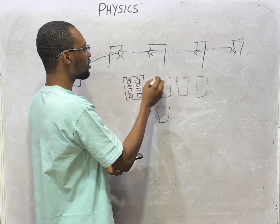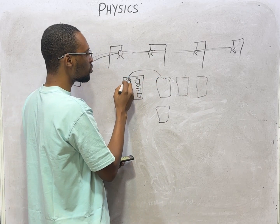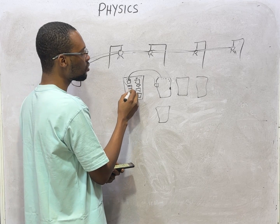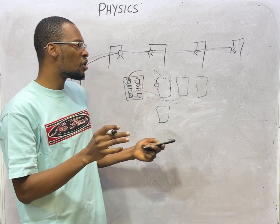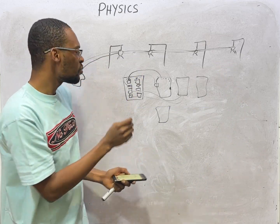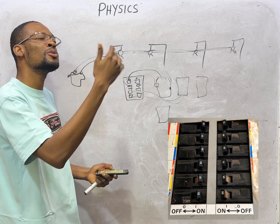You can say: this 13-amp breaker connects to all the bulbs in one room; this one goes to all the wall sockets; this 15-amp one runs to where the AC is. For each room or each lighting section, you have a switch or a space in the distribution board. So when you want to turn off only a particular room, you know the connections going to that room and switch it off. A fault in one room will only trip that room's breaker.